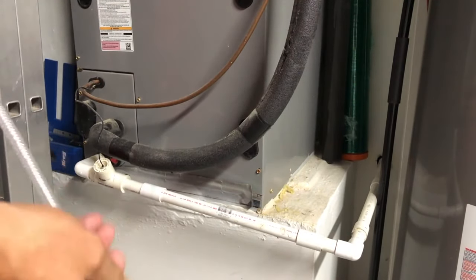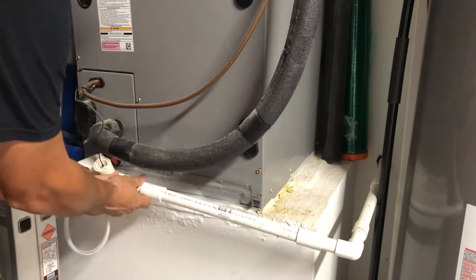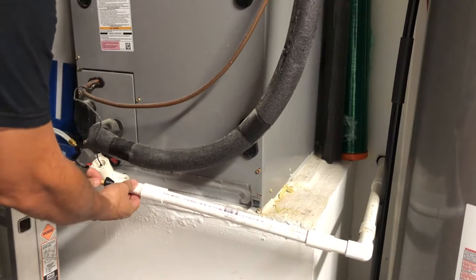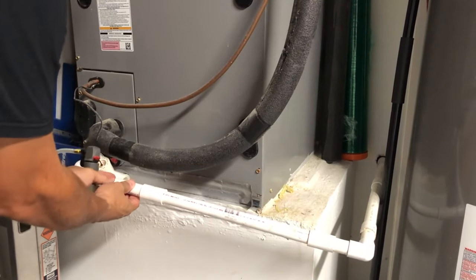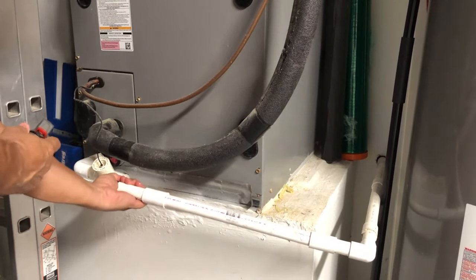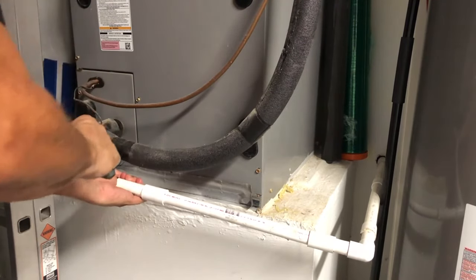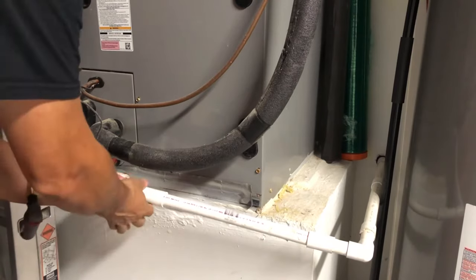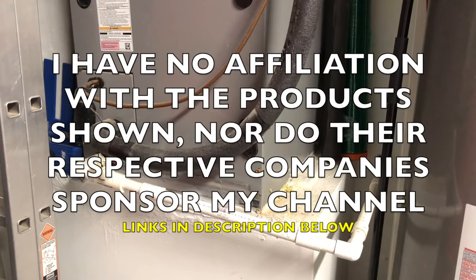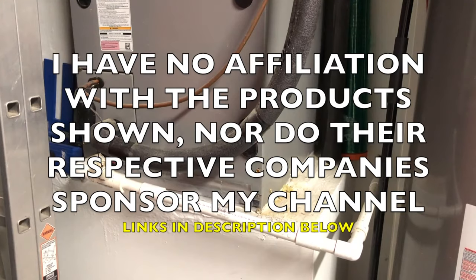When you put the safety switch down, you're ready to go. I simply remove the PVC pipe cover, push this rubber tip into the PVC piping, manually hold it there as firmly as I can, and then blast out the blockage. Sometimes it'll take one canister, it might take two, but guaranteed this will clear any obstruction in that line.